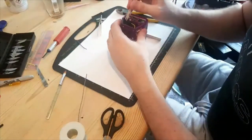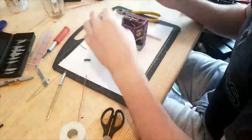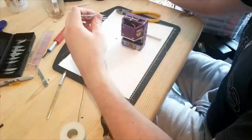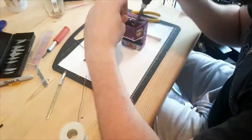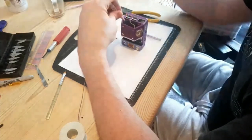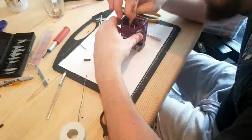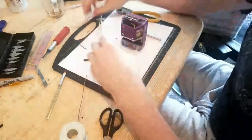So I've soldered it to the always-on connection, which I did not want to do. It looked good from the top. I can't really see in there. I've got my glasses on, but I've got no light. So I just assumed it came off that one. All right, come on, off you go. Desolder. All right, so let's have a quick look. Where do I want it to go? I want it to go on that side, don't I? Okay. So let's bend that leg out of the way.